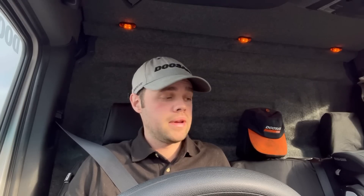It's Wednesday morning. I've just spent the last hour and a half in the workshop office with a bit of admin and a couple of bits and pieces to download. I'm going to a DX225-7 — actually the one I serviced this time last week, with the camera on the front grille where the plug was damaged. I'm going to have a look at it for a complaint that the arm is dropping. The reason I'm setting off a bit later than usual is I phoned site yesterday afternoon and they're going to work the machine this morning so everything's up to working temperature, which will save me a bit of time.